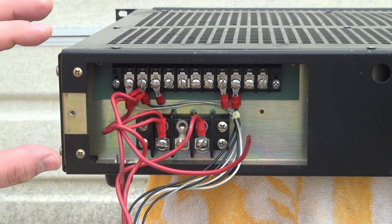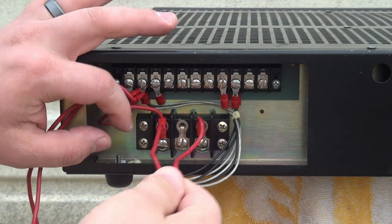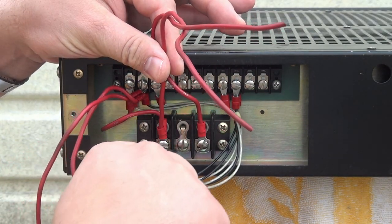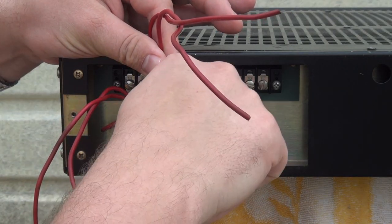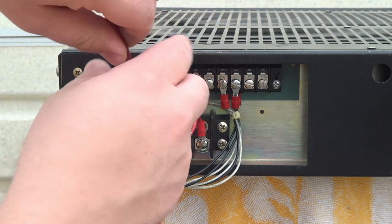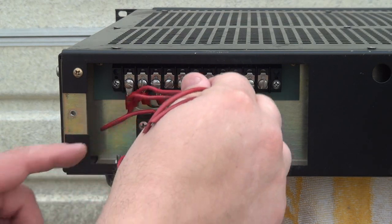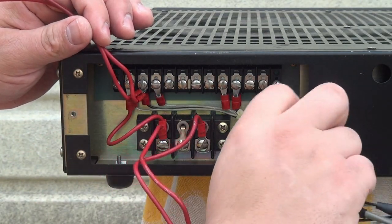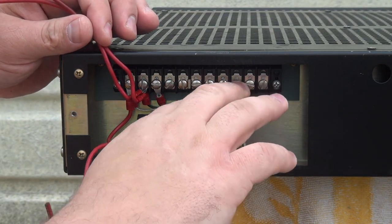As I thought, what we see inside here is: these two red wires are the main power outputs. Plus, minus, and GND are labeled here. These two wires look like they're from the negative sense. This wire is the positive sense. And then both of those sense lines are broken off over here.